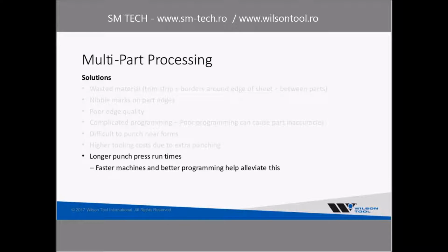Longer punch press run times. I guess probably the main thing that has led to that is just the fact that current machines are much, much faster. So back 20, 30 years ago, when single part processing was much more common, part of the problem was the machines just really weren't punching very fast, weren't moving the sheet very fast. So to add all this extra punching really added a lot of extra runtime. That has gradually changed, and machines do run a lot faster now than they used to. I think you guys are mostly aware of that.